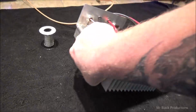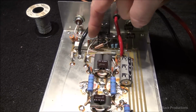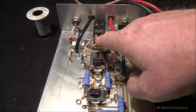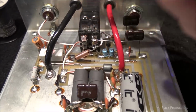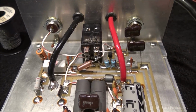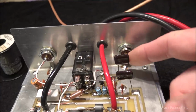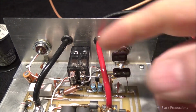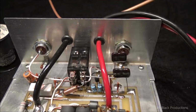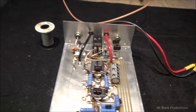And the other thing that we had happen is the pass-through. So as the RF comes in, it goes across the relay connection here. If you notice, there's some missing components here. There was a cap in here that helps pass the bypass tune through the box. Then it goes down, goes across, goes through another capacitor as a blocker, and then comes back out. Okay. We're going to replace this capacitor. It's gone. MIA. Not even any little fragments of it left inside the cabinet.